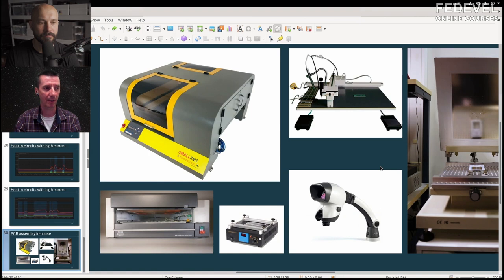Tell me about the bigger automatic machine. Can you use cut strips for it? Yes — you slide them into a tray, define the pitch and distance between components and where component zero is, then maneuver over the component using a camera. Once satisfied, you say this is where the first component is, and it steps every 2 or 4 millimeters in that direction.